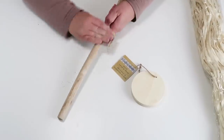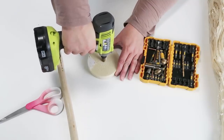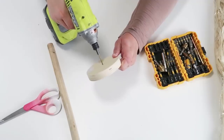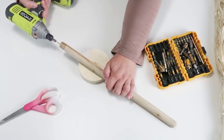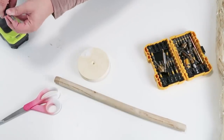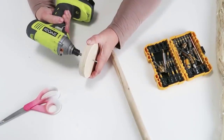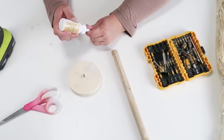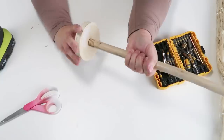Then I went ahead and took some wood putty to fill the hole and grabbed my countersink drill bit to drill down into that wood round so I can sink my screw down in there, allowing it to sit nicely on a table without scratching. I also drilled a hole in the wood handle of the plunger dowel so the screw could be threaded all the way through without causing anything to crack or splinter. I'm comfortable with my drill, but if you're not, definitely mount things in your work area before drilling rather than holding them by hand.